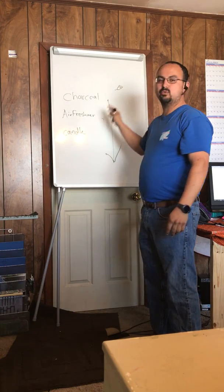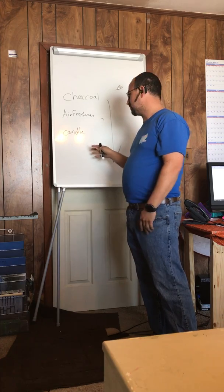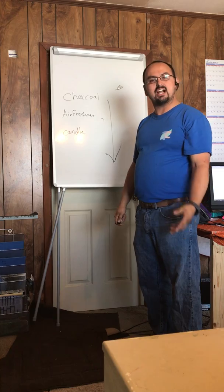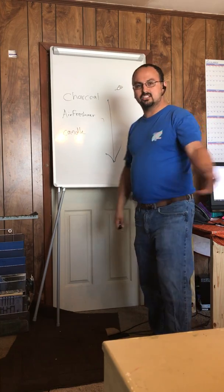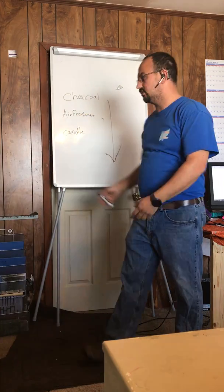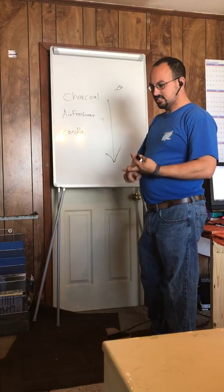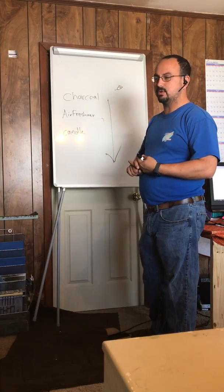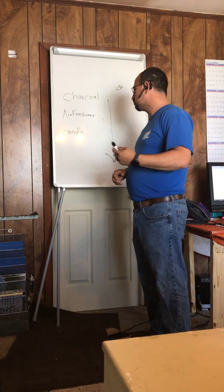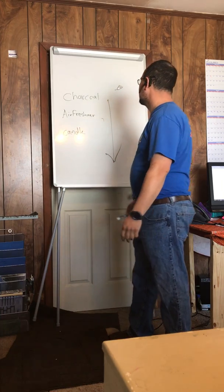But whatever floats your boat, just remember, don't be surprised if the technician shows up and goes, ma'am, your filter is completely caked up. Well, I just changed it 3 weeks ago. I can't imagine what happened, and it looks like a Catholic church in your house. Well, I mean, that's what happened. So watch out for that kind of stuff. Too much air freshener. Too much burning candles too frequently. I mean, we've seen black soot build up in filters from burning candles. So watch out for that. Not saying don't do it. Just be aware that you might need to change your filter more.